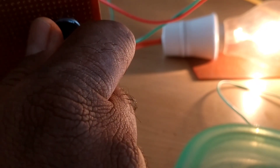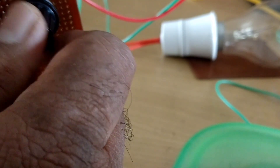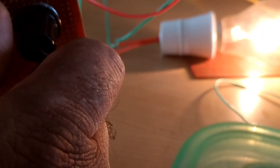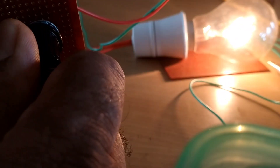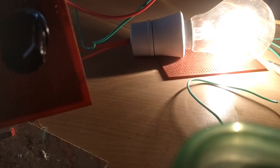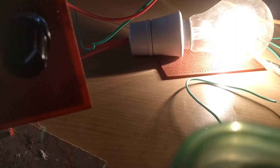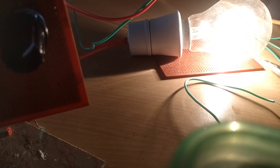Again, with the 4-point switch you can see it is in the half position. Now I am going to show you how the bulb glows according to the regulator: half position, low, medium, medium again, and now it is high position. According to the circuit diagram, we have demonstrated the ceiling fan capacitor-type regulator and tested it using a 100-watt bulb.